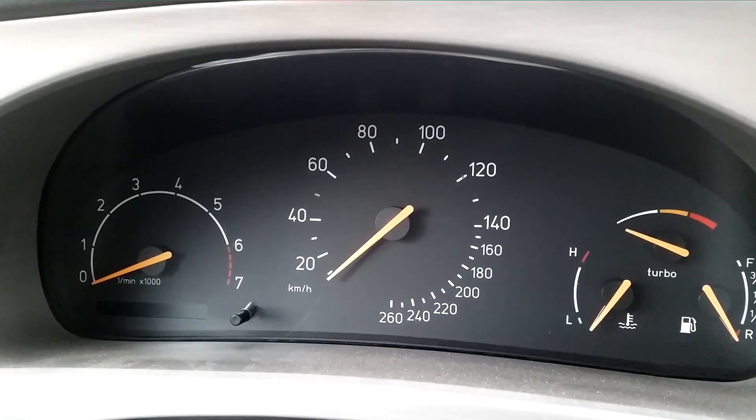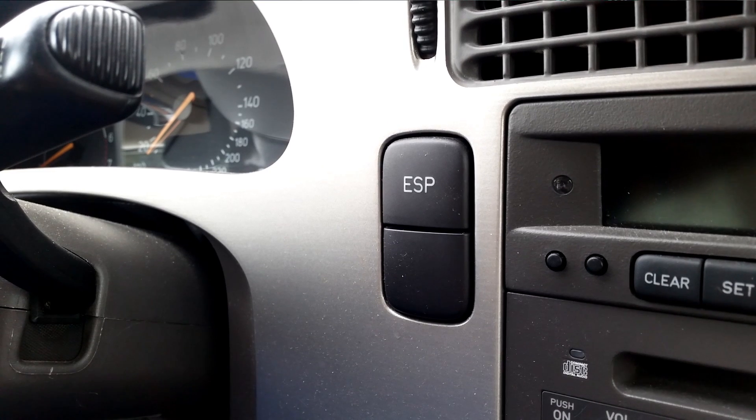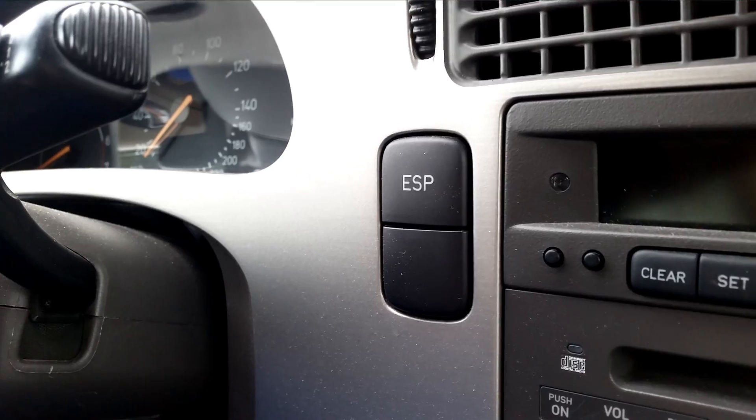Because this video is the first video on this channel on tuning. Since this car has ESP, there's an easy way of adding a connection to the P-Bus via the steering wheel angle sensor.